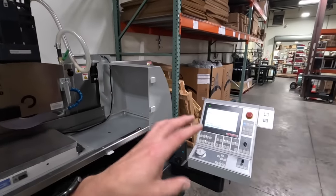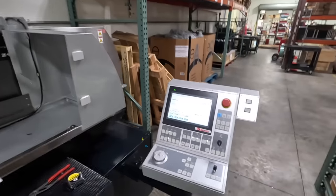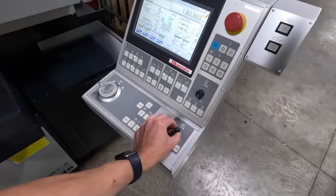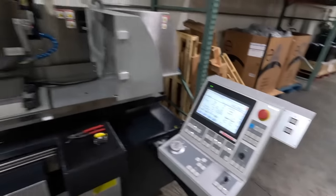One shop even has space blankets wrapped around certain parts of their machine to keep it stable. This is still a C-frame machine like a mill — you've got your base, a column, and an overhang — so you will have some deviation or flex as temperature changes and the machine warms up. That's one reason we went with the table dresser: it isolates that movement out, versus an overhead dresser where the dresser is also bending or flexing with your column. I wish the control were more intuitive and easier to learn. I also don't like the x-axis having a potentiometer — I really wish it were programmable for consistency across parts.